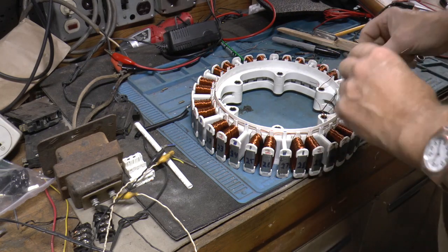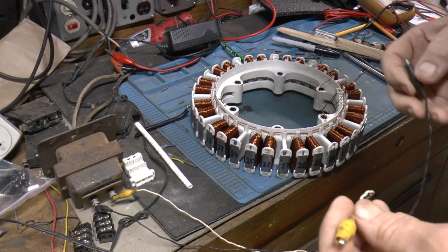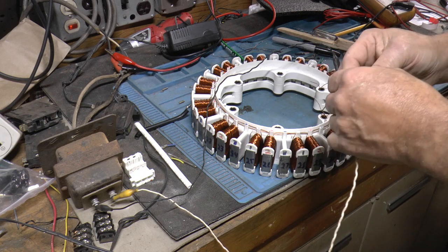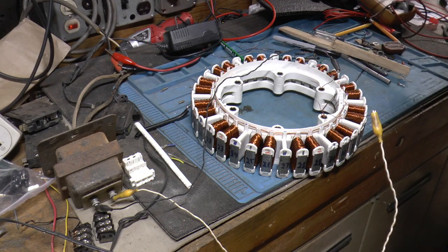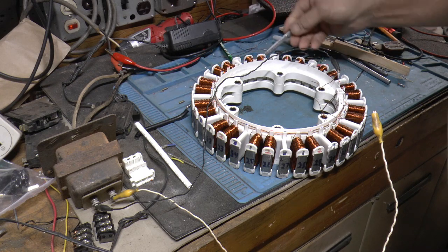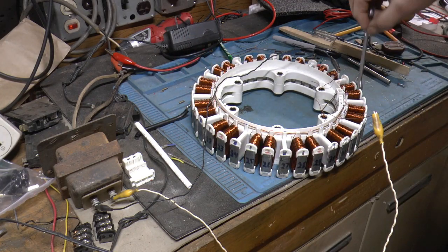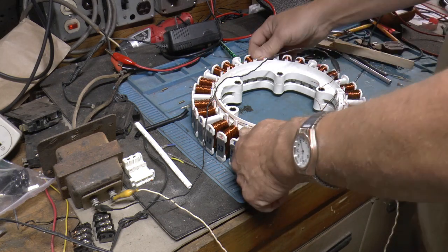Got the last coil wound, got the leads run out here, and gonna hook this transformer, 24 volt, just a doorbell transformer, an antique one. And we'll put that on one end, this on the other. And it seems spark, so okay. And then you can see we got magnetism. Okay, and I'll leave that on there for a bit, just to make sure none of them get warm.